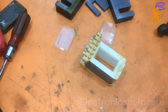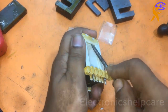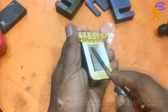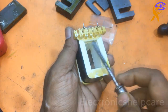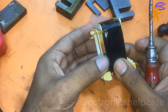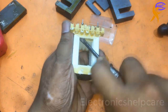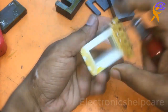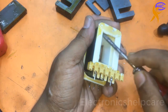It's better to make it a little bit firm. Now I can open it like this. You can see the primary layer. The secondary is okay but the primary is shorted. We need to rewind the primary and fix the transformer again.